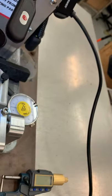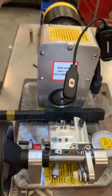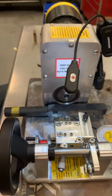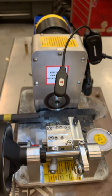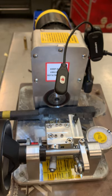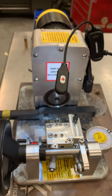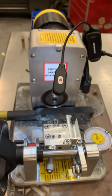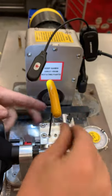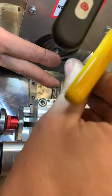Now let's say you want to change thickness. Say you've got another gun that wants to go to 13.2, or you want more neck tension, or you're running just a bushing or expanding — whatever it is, you want to go thicker. So let's take this and just back it up, re-tighten it back down.